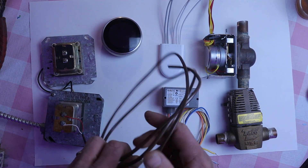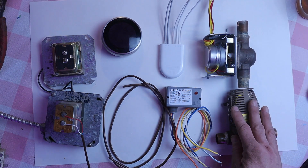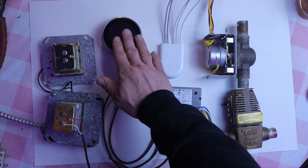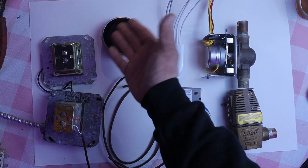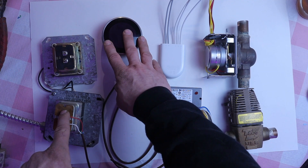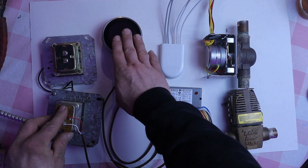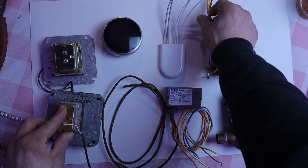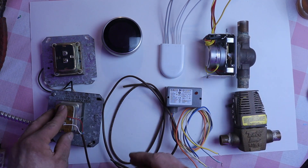You're going to need a little bit of wiring — a three-wire thermostat wire works fine. I'm going to show you how to hook all of this up to either a Honeywell or a TACO zone valve. To begin, we're going to find the two thermostat wires coming from our first installed Nest thermostat and find those wires down by the zone valve. It's going to be a red and a white wire. The red wire from the original load on the transformer will go up to all the red wires on your old thermostats — disconnect your new thermostat wire from that bundle. The white wire coming back from your thermostat is going to one of the yellow wires on your Honeywell zone valve, or to terminal one on a TACO zone valve. We're going to disconnect that as well.